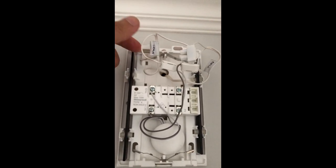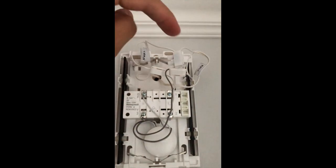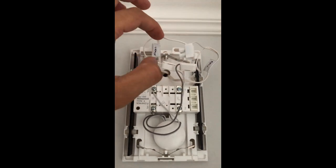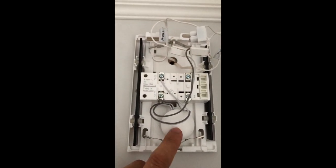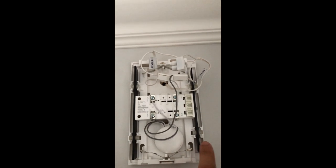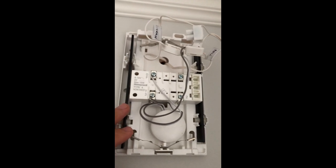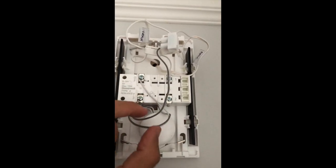I've labeled the wires to make it easy to follow. You've got the transformer wire coming through the wall and the bell wire. The ends are split, with one going into this joiner and one from the transformer split as well. It's really important not to obstruct the mechanical parts of the chime — that's what makes the noise. Some people have complained it doesn't make the right sound, and that's likely due to wires obstructing the mechanism.